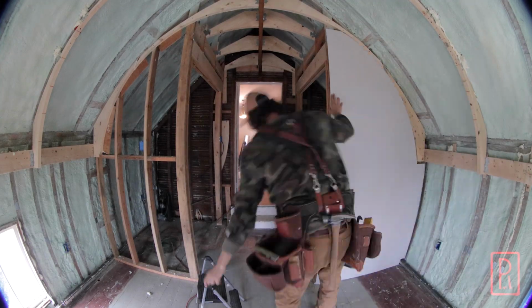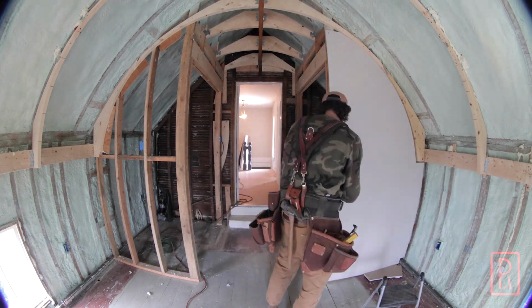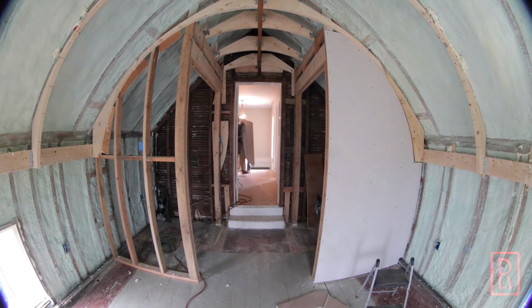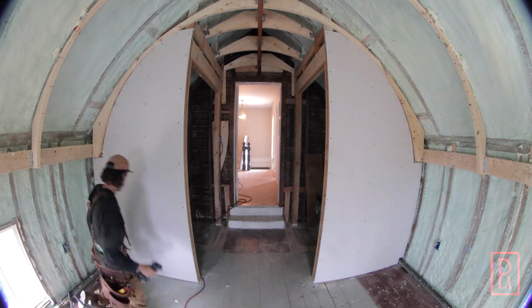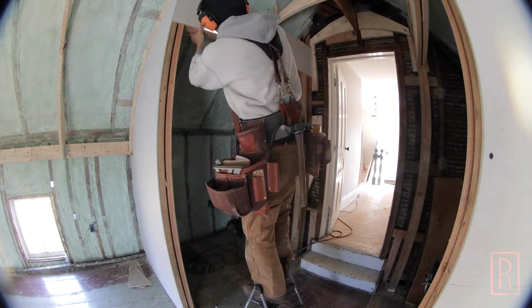I can then work out the shape of the pieces that need to go onto the closet walls. I'm using a full sheet for those and need to make sure that the edges toward the center of the room follow the corner studs as tightly as possible. The rest will most likely get buried behind some framing or the wall furring I still need to do. I also ran sheetrock over the closet doors and the entry door.